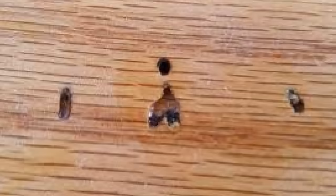If you have a basement or crawl space, check those areas as well. Another obvious sign of termites is wall damage — painted surfaces that appear water-damaged, or drywall that is bubbling, bulging, or caving in. Woodwork may appear cracked or sunken in, and you may see kick-out holes and frass. Don't forget to look at ceilings and floors too — ceilings starting to come down or bubbling, and floors that are soft or caving in, could all be signs of termites. If you see these signs, it might not be a bad idea to treat these areas first.